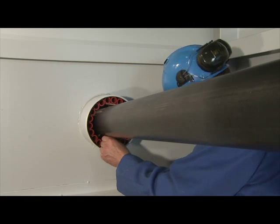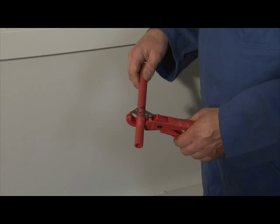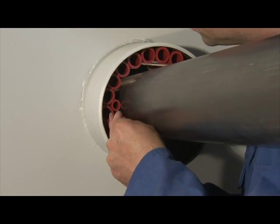If the pipe is ducted angled, the remaining openings around the pipe should be filled with sleeves cut to length. If necessary, pliers can be used to insert the filler sleeves and ensure tight packing of the sleeves.